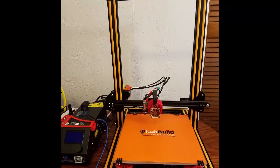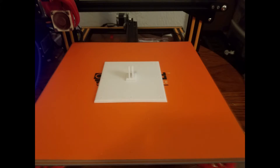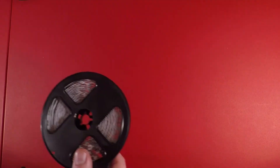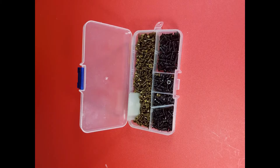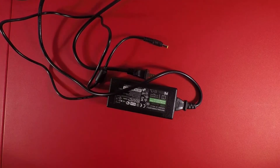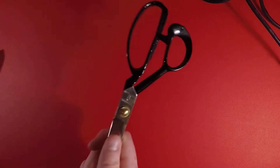For parts and tools you will need: a 3D printer, the faceplate, the body where the components will go into, the mount, the diffuser printed in clear filament, and PETG for the higher temperatures the LEDs produce. 5 meters of bright white LEDs on a strand, a 2.1 x 5.5 mm DC power pigtail female connector, extra 20 gauge wire, an on/off type latching button, 20 gauge solid core wire, super glue, 3 mm screws, a screwdriver, a hot glue gun, at least a 12 volt 4 amp power supply, wire cutters, a soldering iron, and scissors.